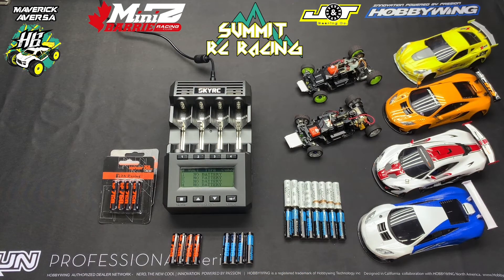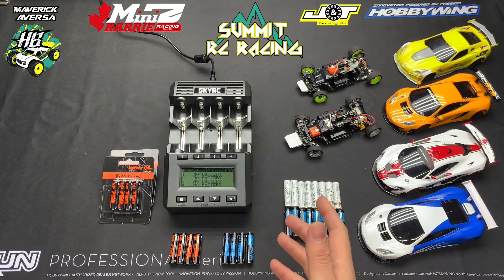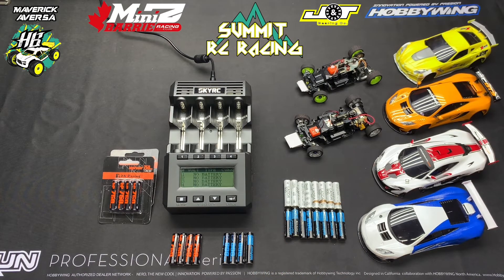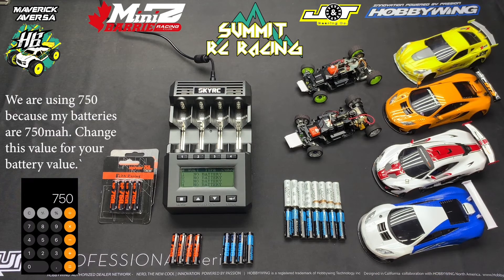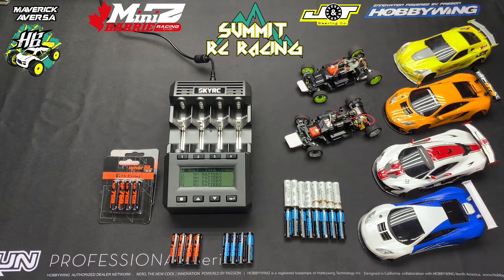Now one of the first things I did wrong was I didn't break in the batteries. With nickel metal hydrides, when they're new or even when you store them for an extended period of time, they become chemically deactivated. So you need to break them in — you're going to charge them very slowly and force them to a full charge. You're going to do that at 0.1C and discharge them at 0.2C. So the math: 750 times 0.2 comes up to 150 milliamps — you discharge your battery down to 1 volt at 150 milliamps. Then you charge it at 750 times 0.1, which comes up to 75 milliamps, and charge that up to 1.65 volts.